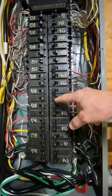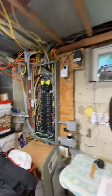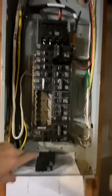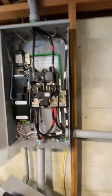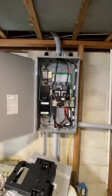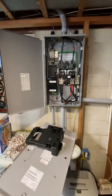There are basically all twin 220 breakers — floor heats, electric hot water heaters, electric dryer, electric stove. So that's all the power. This is the primary setup for my kitchen stove because I had to pull a 60 amp breaker off of that. And then a bunch of heavy ones down here for the other stuff — floor heats, all going to be 220. Now we're going to take a walk outside and I'll show you what the power walls look like when they're hooked up. My power walls are at their farthest extent, 155 feet from these panels. Conduit runs 137 feet underground to my shed, so we'll take a walk out there.